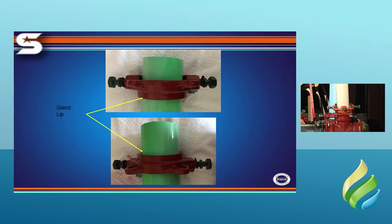Make sure this is set to 100. Yeah, so you definitely want to make sure you have a torque wrench on site. Torque for your T-bolts is, as I said, crucial. You don't want to under-torque it because then you won't get compression. You don't want to over-torque it because I think two slides from now it'll show you why. And it helps if you use the right socket. Right socket. It makes it easier. There you go. Another thing with torquing is you want to make sure you have smooth motion so that you're not jerking it.